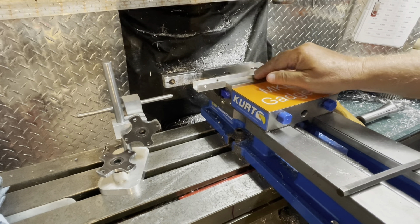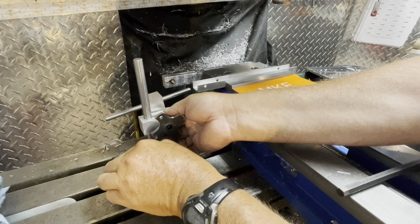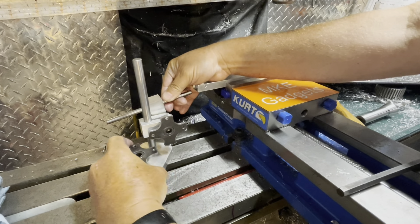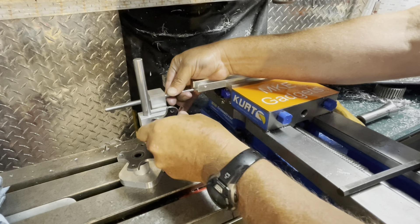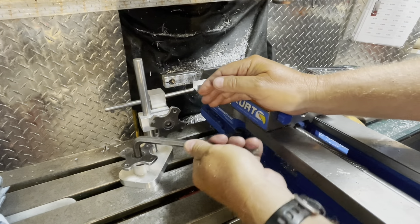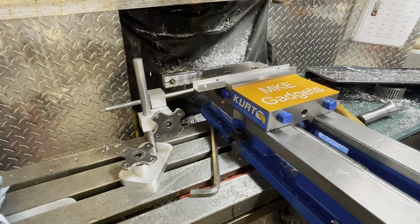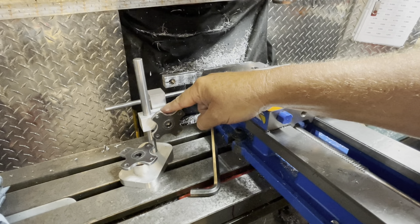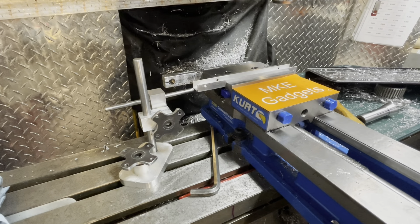So here I've got a piece of stock — let's say I want to drill or mill it and I want to set up a vise stop. Now with my new modified vise stop, I've got these nice hand wheels on there. I get close, tighten that one up, and this one tilts as the rod goes in and out. I adjust it a little more, move it back, get it close — and there you go. I can tighten it pretty tight by hand, but I wouldn't mill it without using the Allen wrench. Voila — one tool: tighten it down to the base and tighten it to the part. This is my drill vise modification — put these little hand wheels on the half-inch cap screws and made these two parts. I think this is going to work out real well. Maybe in the future I'll break these edges and engine turn the whole thing, but right now I just want to finish.